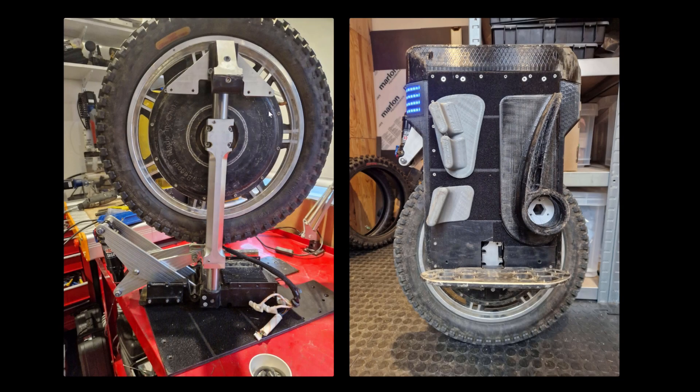This is the parts assembled onto the chassis — it went together quite nicely. I did find that I had to machine off a small amount from the mount on the cross beam here because of the difference in width of the new linkages — I think it's a couple of millimeters off the sides, which I used my little mill for. I also had to fettle out a small bit of width from the main casing here to fit things in properly — I used a Dremel, which wasn't too difficult, plus a bit of a file.